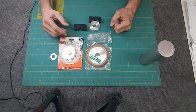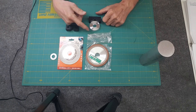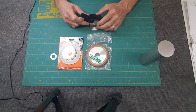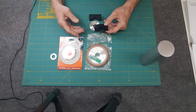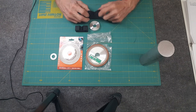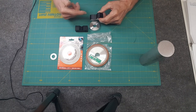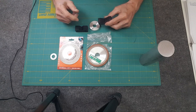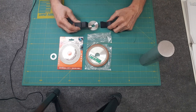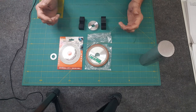Just put tape, or I have plastic parallels that I machined a long time ago that would probably go here. These things are a blast to make because it's plastic. You can make incredibly deep cuts, so you're done within a few minutes making them. I used my own precision-made angle blocks, the 45 and 60, to make these, mounting them in the vise, and then just took the 3/4 end mill over it, and same way with this one. So that's just kind of where I am with this.